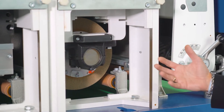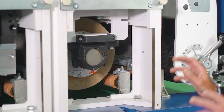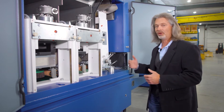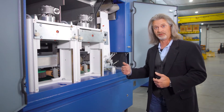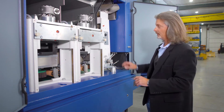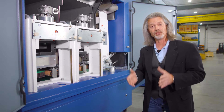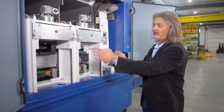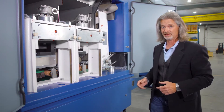This head is called a brush head. Brush heads on the 5 Series machine are interchangeable. What you see here is what we call a barrel brush — it's a cylinder. This is used to create not only a deburring effect, but also a surface finishing effect. This machine is designed to do both. You can do deburring and surface finishing in a single pass, or you can configure it just for deburring. If you configure it with a combination of abrasive belt and barrel brush, that would be suitable for an application where you not only want to deburr, but you want to get a nice number 4 finish on your part.